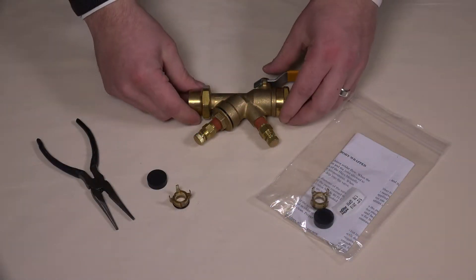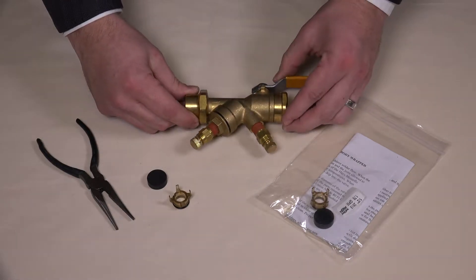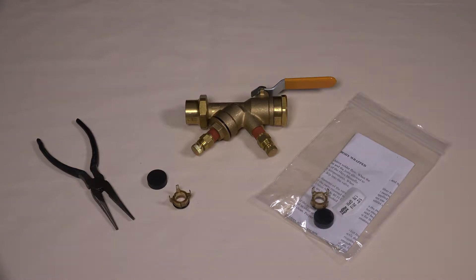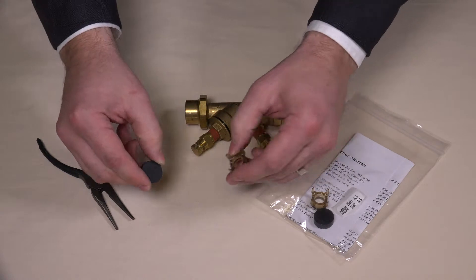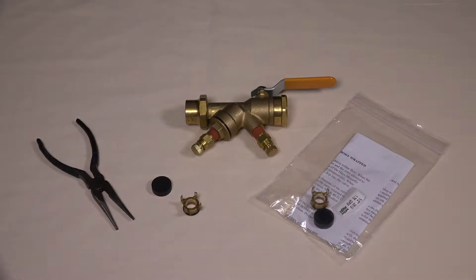Here is a close-up of the Hayes model 2519 automatic balancing valve. The balancing components are what we consider our measure flow design. These consist of two components: the diaphragm and the orifice plate. These pieces work in conjunction to limit the total flow to a desired amount, often the maximum GPM allowed through a coil.